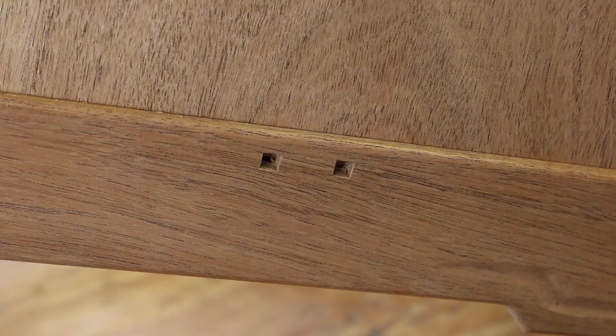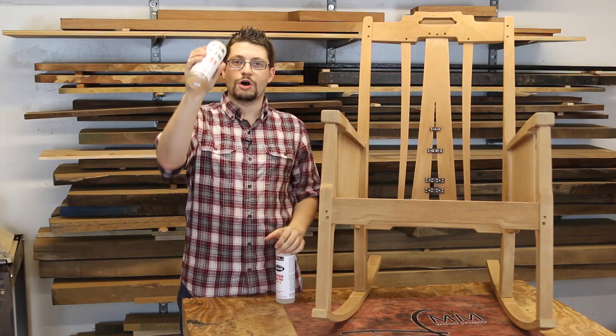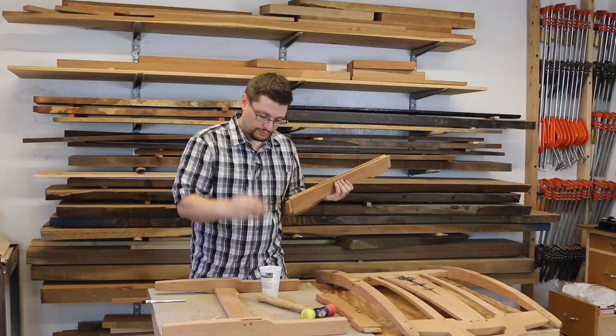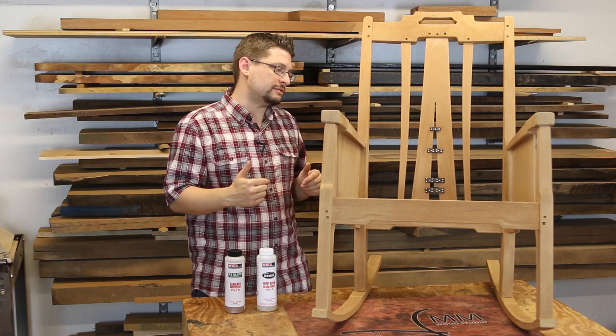The mortise back here had a small little hole where I had drilled in, and that was exposed, as well as the ones on the rails. The reason I wanted to put ebony plugs in these now is because I used epoxy. Here's the epoxy I used — this is System 3. Part A is the resin and part B is the hardener, and I used the slow hardener, which when mixed gives you an hour of working time. The reason I did that was there's a lot going on in this glue-up — not only do you have to glue the rails in, but you've got to glue the arms and the panels in, and all of this has to come together. It's like one big puzzle piece and it all has to be done right.